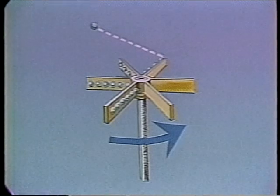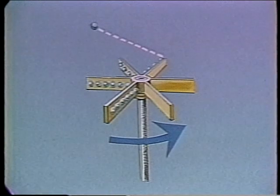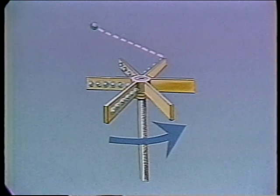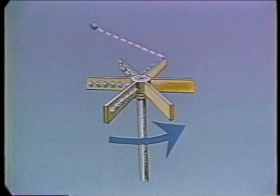Now let's look at individual droplets of water. The impeller is turning rapidly and therefore centrifugal force causes the droplets to start moving very rapidly toward the outside of the impeller. As the droplet gets right here, let's say it freezes into a ball similar to a hailstone. If there's no housing to stop it, since it's traveling at high speed, it will be thrown a good distance, but no useful work will be done.